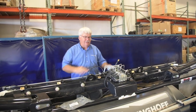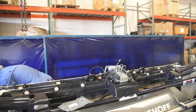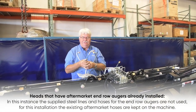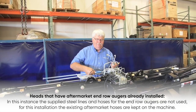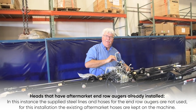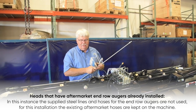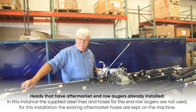Next, we add the steel lines that go from these ports out to the side. In the kit you'll have four steel lines — there are lefts and rights and two different lengths. Stack them in from shortest to longest. There are also rubber grommets that go around the steel lines, and they'll snap down into the mounting brackets of the backbone.